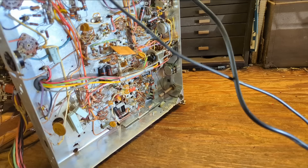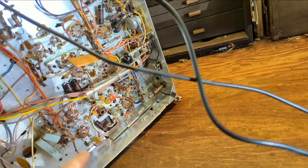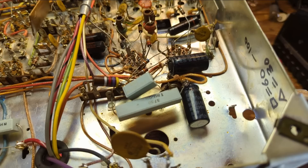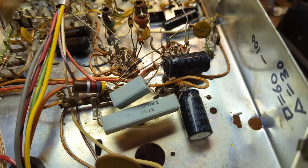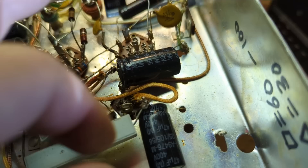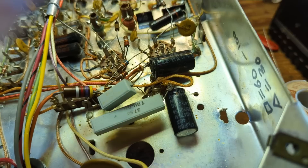Let's mark down the electrolytic values for the shapes and replace those first. The electrolytics are replaced. I have my own methods of installing parts — some people insist you need to install a terminal strip for your ground, but I find grounds that already exist on the chassis and keep connections real nice and short. It's just as good as installing a terminal strip — maybe not as pretty, but no one's going to look under here anyway.